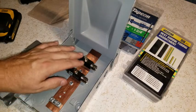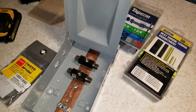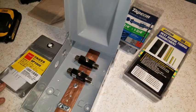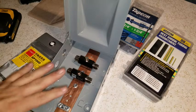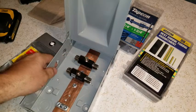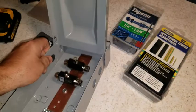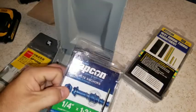They're user serviceable, they'll probably never need it. I couldn't find a bar strap at Lowe's, so I took a copper pipe — I think it was three-quarter inch — and just beat it down with a sledgehammer and made it flat. Flat is better for a ground strip. I mounted this through the back, drilled holes in it so I can mount the box.